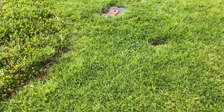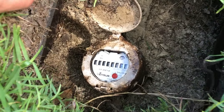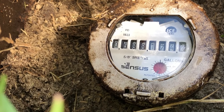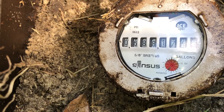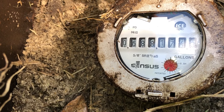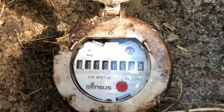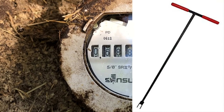This is where my water meter and water shutoff valve is. I'm going to remove the cover and expose all the internals. This is the water meter, and you can see all the readings on it. The little red dot is actually the flow or leak sensor, so you can see if there's any water being used in the household. Right in front of it is the water main valve shutoff, and it's pointed in the up direction towards the pipe, so it is on at the moment.